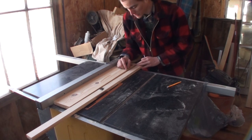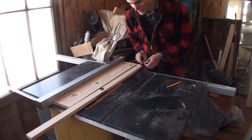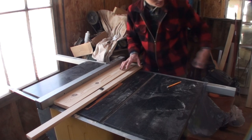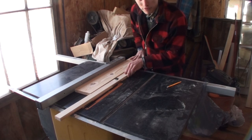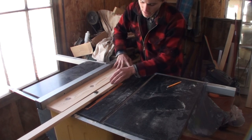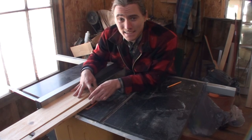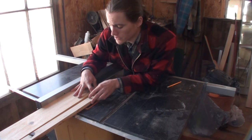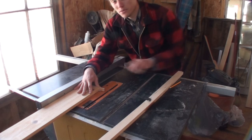On a four-sided taper, you then have to readjust the screw by backing it farther out to compensate for the material you cut off on your first two passes. With the blade raised and the table saw starting far enough back so it's not touching the wood, you make your pass through. This is a very simple version and not the easiest to use — I was pretty uncomfortable doing it and it was semi-dangerous, so you'll want to make some changes to make it easier to use.